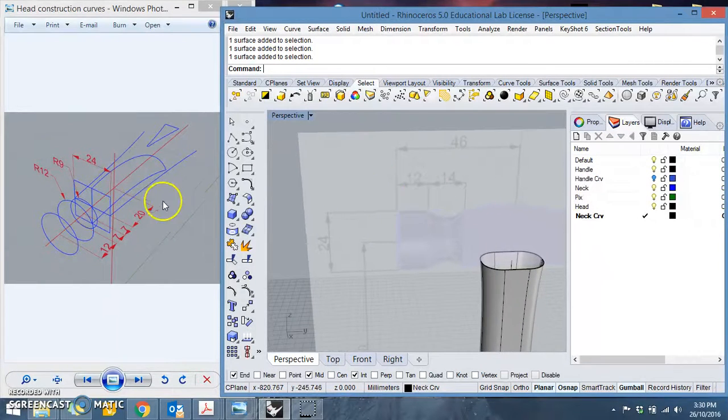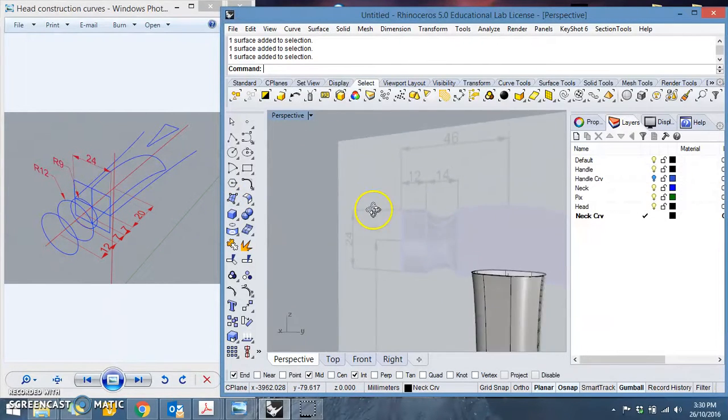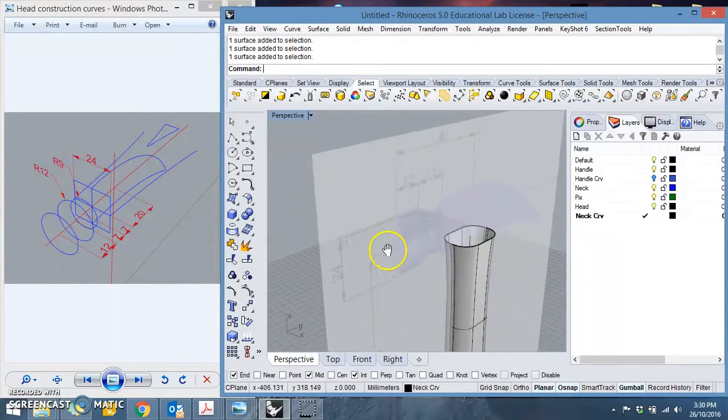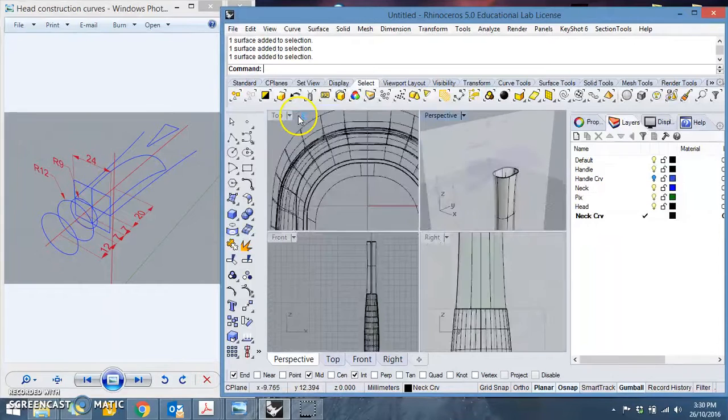There is the radius 12 with a gap of 12 here. You can see there's a gap of 17 here. At the center here, 7, 7, there's another smaller radius here, which is 9. Okay, the space here to here is 46. If you can calculate here, it's probably about that. So what you need to do first is you need to drop in all the circles and squares.